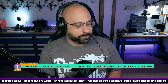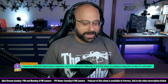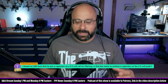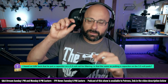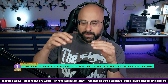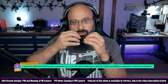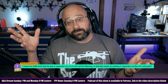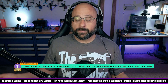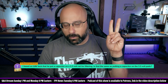Yes, it is. When they talk about the 3.3 volt rail or the 5 volt rail, that is electronics speak for how you design a PCB — you'll have a 5 volt regulator and the output of that regulator will be put onto a copper trace or wire that goes to all of the 5 volt pads. So all of the 5 volt pads on a flight controller are fed from the same 5 volt regulator, and that is generically referred to as the 5 volt rail.